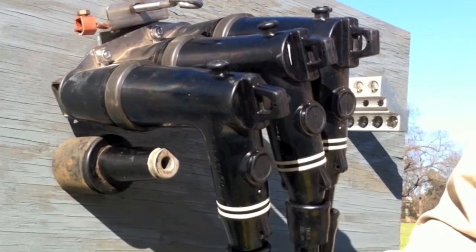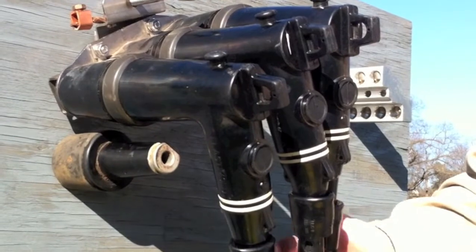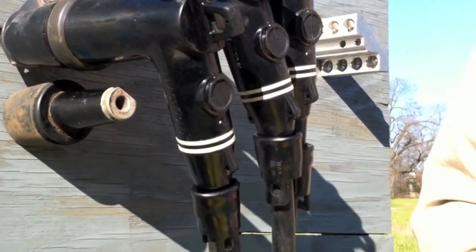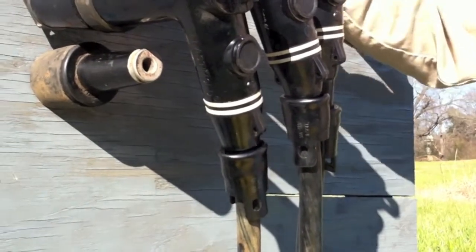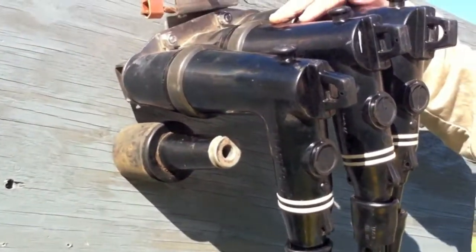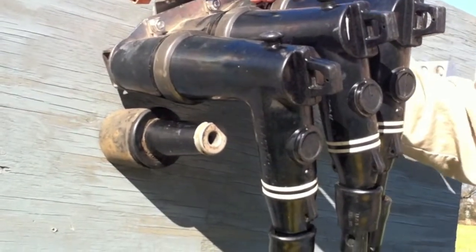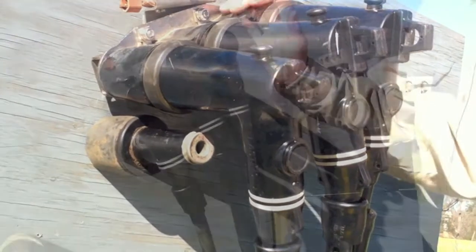Another absolute though is you keep your cables up higher, you keep them straighter, and that takes the stress out of the bends, because the wires tend to, under high load, burn through and then blow out. If you burn up an elbow and you burn up a junction, which are your main two hot feeds, where a lot of your amps are going through, all you change out is an elbow and a junction.